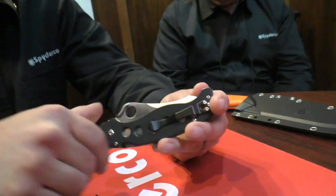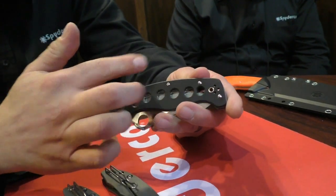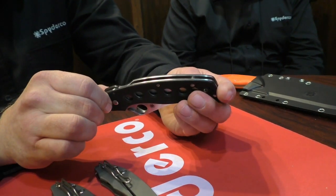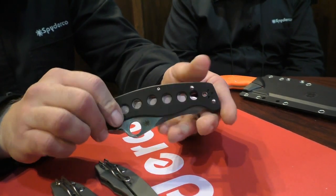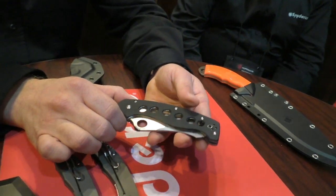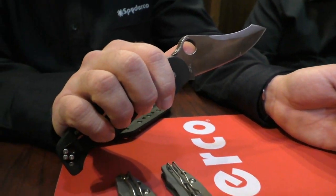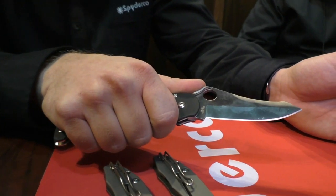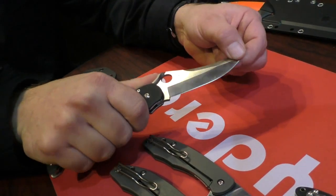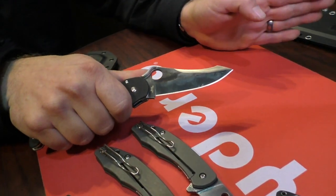It was a knife that we originally made in America with a 6AL4V titanium interface compression. But this one's going to be Peel Ply G10, full liners that are skeletonized, nice reversible clip. Still has your holes so that you can index and reduce the weight. Still has a nice Cobra hood so that it gives you better purchase for your thumb when opening. It's got this nice swedge so that the grind line goes all the way out to the tip, so that you have a nice strong tip for use, but also lightweight with the way it's beveled and the material's reduced at the top.